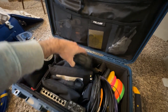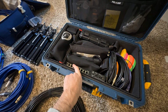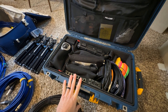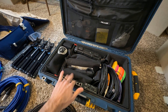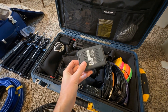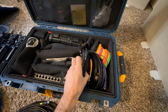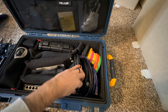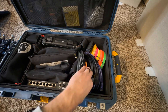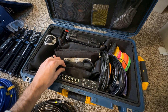I also carry a small network switch so I can connect to a client's local network to control the DSP, because some DSPs don't let you connect a cable directly — they need the crossover cable that's built into a switch. I also have this tiny little router I can throw on a network in case they don't have that, so I can access it wirelessly. Otherwise, it's just a few extra network cables, connections for an analog loopback if needed, connections to get signal out of my Evo 8 over TRS to XLR into a system, and some basic tools like a screwdriver.